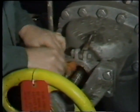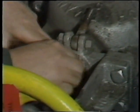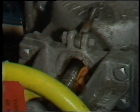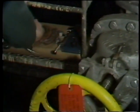There are a number of ways this can be done. In this case, he simply uses a small piece of rag wrapped around the end of his packing removal tool. The reason for doing this is to remove any bits and pieces of packing remaining in the stuffing box, and also to wipe off the surface of the stuffing box and the stem to allow him to inspect them. He wipes out the stuffing box and the stem, and then performs an inspection to determine the condition of these two items.